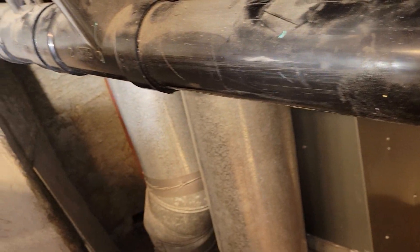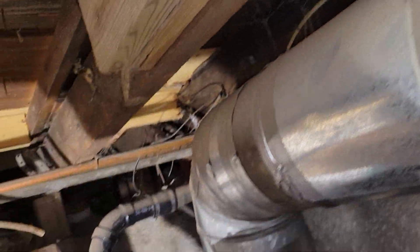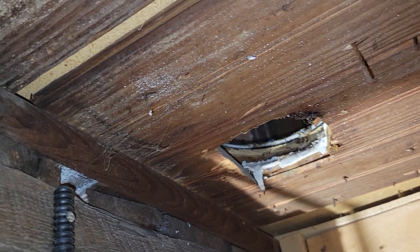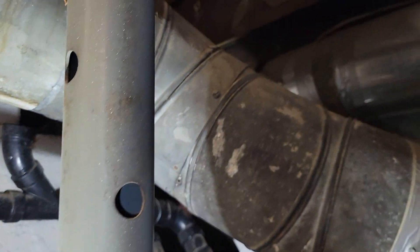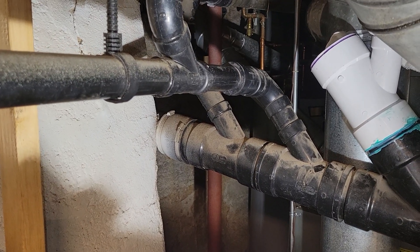I so badly wanted to move this return out of my way, but it wouldn't have helped. There's the hole for the toilet. We have to actually reinforce this underneath the toilet so that when we put screws from up top, it's going to be stable — otherwise it's going to leak. It's taking longer than I wanted to, but it's going to come out right, and that's what matters most — that it's done correctly.